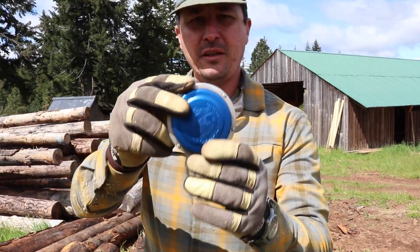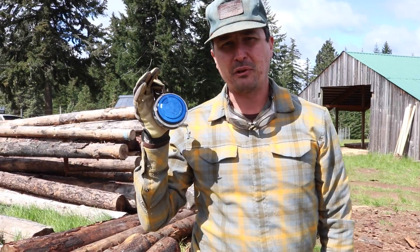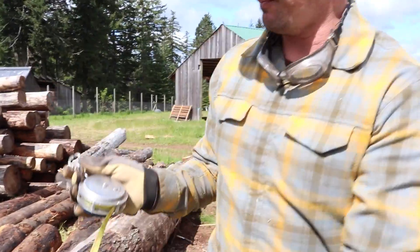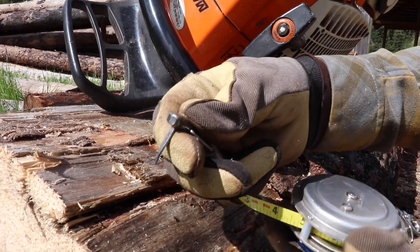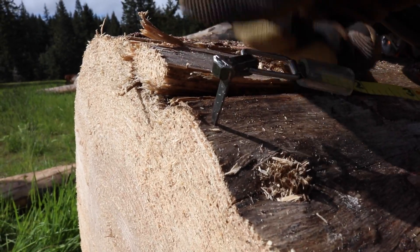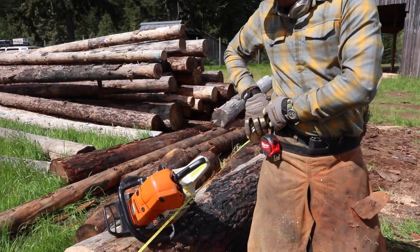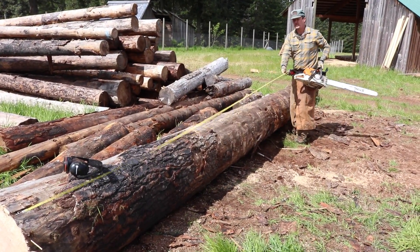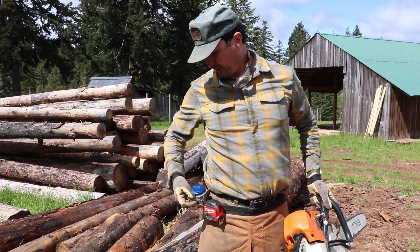This is a Spencer's logging tape — these are my favorite tapes. I found these years ago when I was doing construction and excavating. I didn't know it was a logging tape, but it was the only tape that would last when I worked in the mud. They're originally designed for timber fallers. There's a horseshoe nail bent in a certain way on the end so you can push it into the edge of the log and it holds. Being bent like that gives it a place for your thumb to press without hurting it. Once you stick it in, you can just grab your saw, walk whatever length you need, then give it a little tug and it reels up. They're USA made, super durable — I think they're the original logger's tape, made by Spencer.